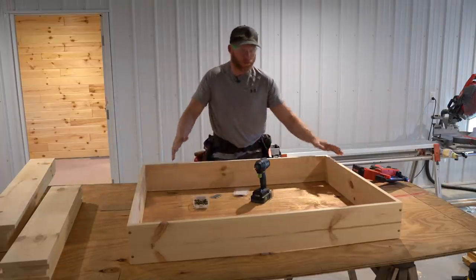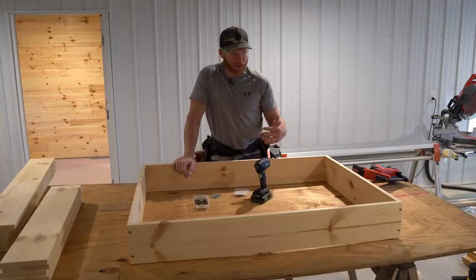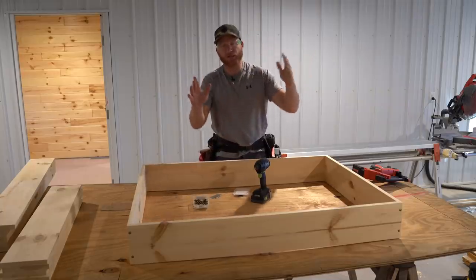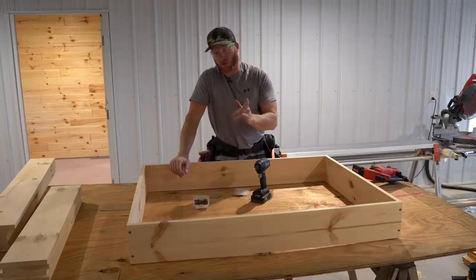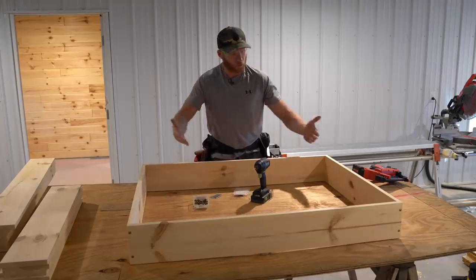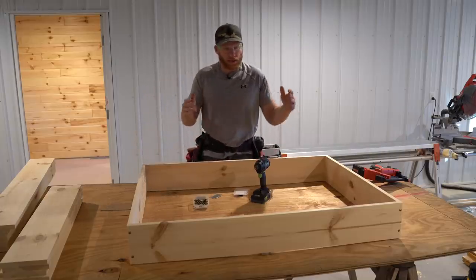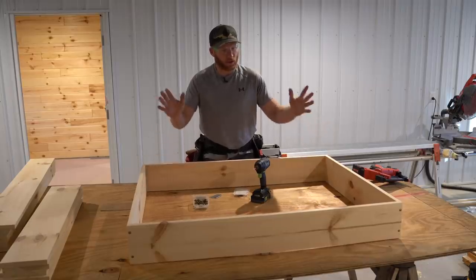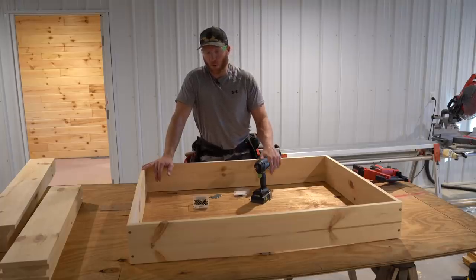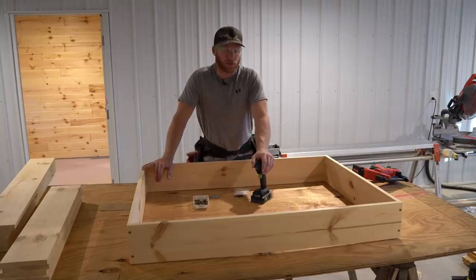Stay tuned to see how I set these pre-built boxes in the windows and line them up perfectly so the reveals are exactly where we want them. While Greg is starting on the base trim and I've got all those window boxes pre-made, I still need to do my casing. But I figured I might as well go ahead and get my walk doors started to get trimmed out, so Greg has something to die into at the bottom. The biggest thing I had to do is go around, prep the door for trim by cutting back any overfill of spray foam around the perimeter, and double-check that I like the reveals.